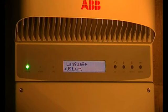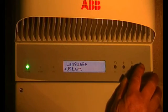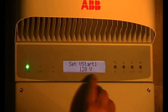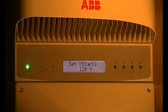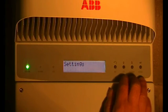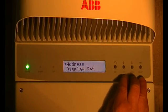You may get one of these and it seems to work fine but it won't start. It may be that on V-start they've put some ridiculously high voltage in — these had 275 volts V-start when they turned up, and I've changed it to 120. So V-start is now 120 volts. You may have to change that to make it work. I'm not going to go all the way through this menu as there's quite a lot.